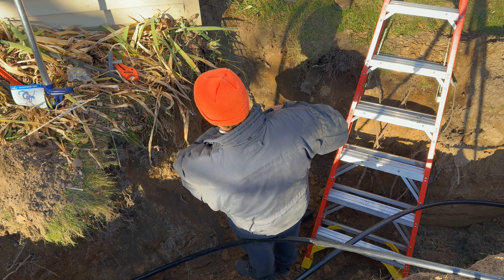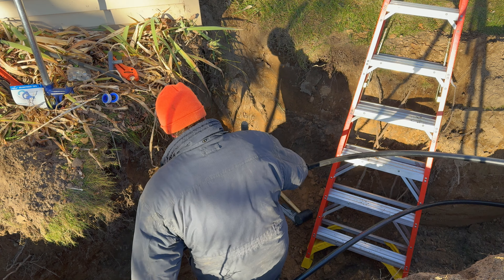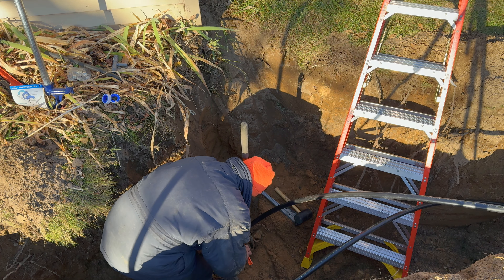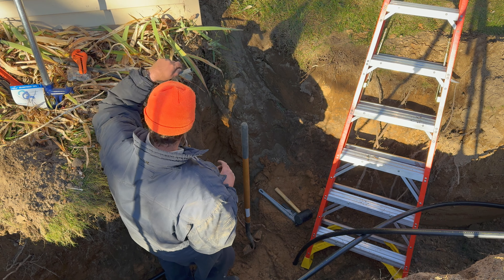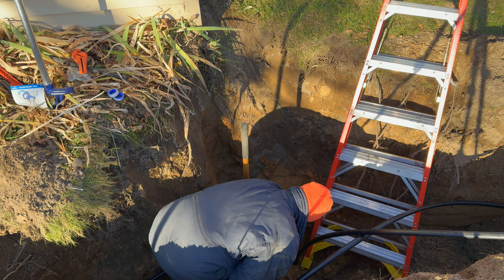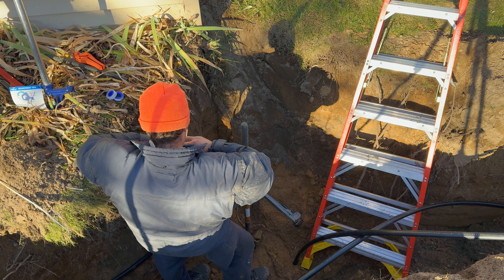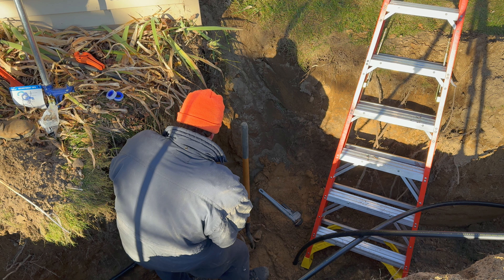At least where I am, you only really need to bury the pipe three feet down, but the faucets I bought are four-foot buried depth - and that seems to be the only buried depth my local hardware store sells. I kind of had two ways I could have gone with this: bury it four feet down so it's frost-free, or go really shallow like a foot down but then I'd have to blow the line out every year. Obviously I decided to go with the four-foot-down option so I don't have to blow the line out every year.